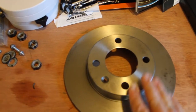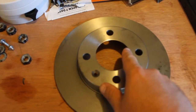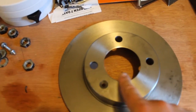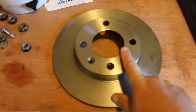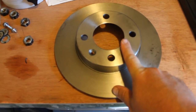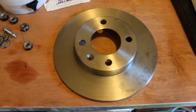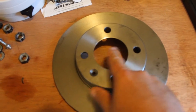What I was able to do is source this disc brake — or a pair of these discs, actually. The crucial hole here is 65 millimeters in diameter, which is exactly what I need for this project. For all intents and purposes this is from a 1997 1.6-litre Seat Ibiza or something like that, but the car doesn't really matter — what's important is this 65-millimeter hole.